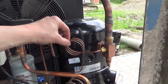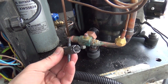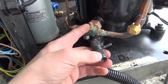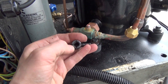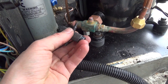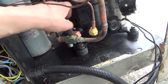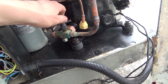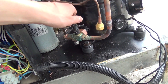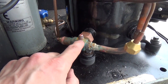I've got the low pressure switch capillary done, doing the high side. These threads are a bit rusty — I've got this thread chasing tool. It does normal quarter inch flares; I think the thinner one is the older automotive ones. And I think that's a thread chaser for Schrader valves, and that will take the Schrader valve cores out — so it's a handy little tool, I think it's made by CPS. Actually that's not too bad — maybe it was the nut that tightened up the threads.